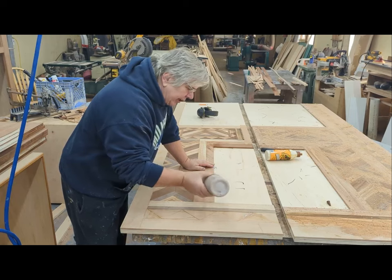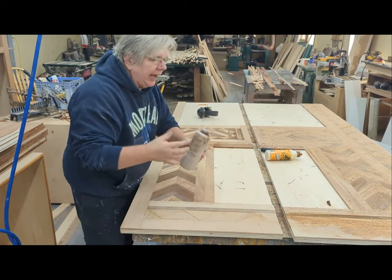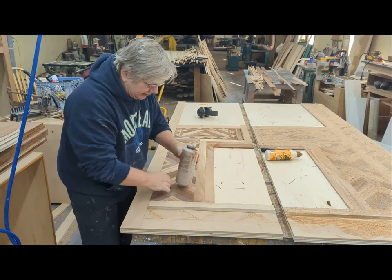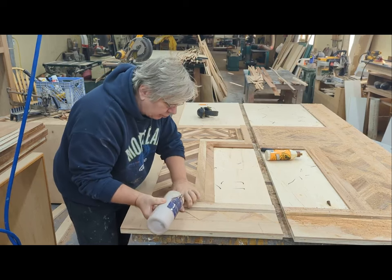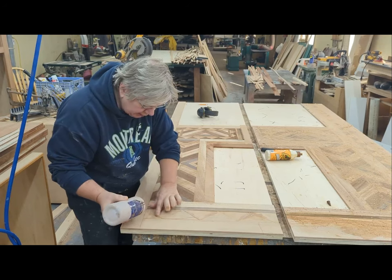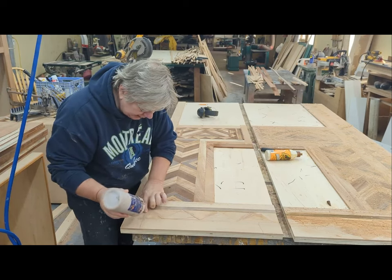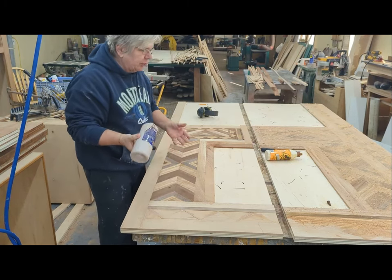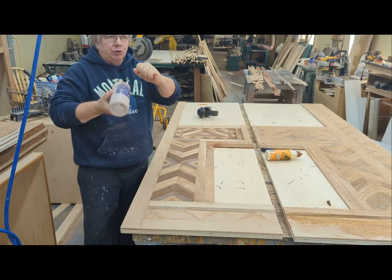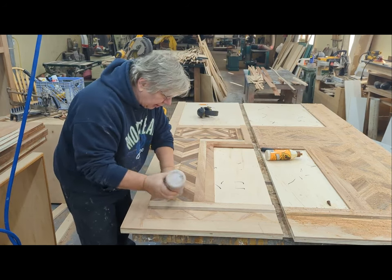This is what counts — I want this to look like one piece. I'm going to make it a little thinner and there should be almost zero wood movement. It'll just be like a veneer piece — no seasonal movement. I'm putting the filler on my finger right now. It dries like a medium brown and it's stainable. Don't put wood putty in there because wood has a little movement and the wood putty could pop up. Use glue with little pieces of wood or shims instead.